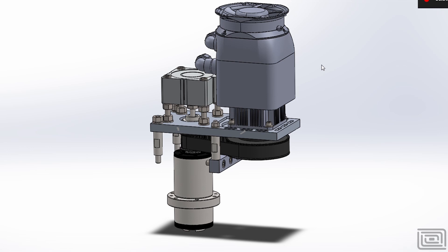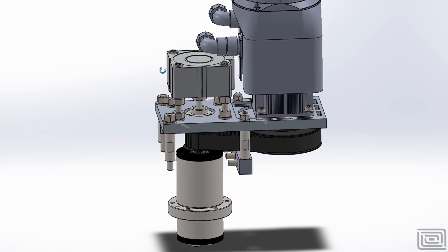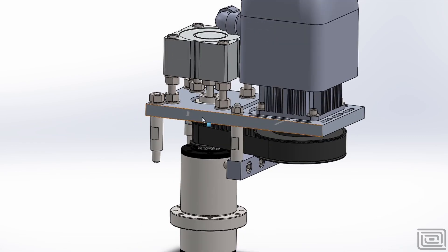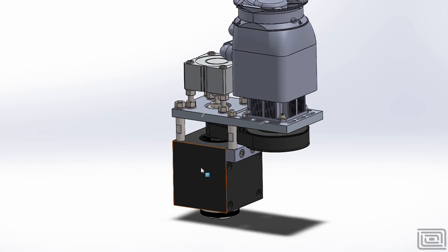I'm probably not going to be running it very long or loading it very high, so I'm hoping the servo will hold out — but time will tell. I'm using a 100mm diameter pneumatic cylinder with a 5mm stroke to open and close the drawbar. The plate itself is about three-quarter inch thick 6061 aluminium which we're going to machine up on the CNC. All in all I'm hoping the system works, and in the next video we're going to be casting this bracket — making the mould and pouring the metal. Stick around if you want to watch that.